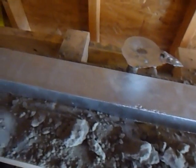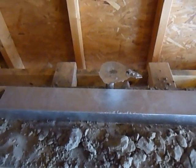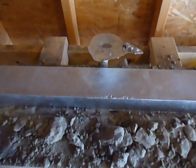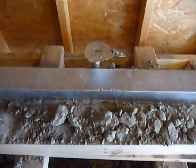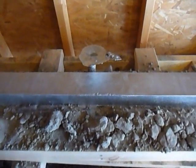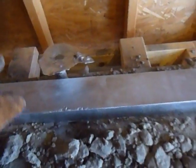I'm definitely psyched about my new molding sand that I put together. It's 100% Olivine and Southern Bentonite. There's a little issue here, but since there's supposed to be only 75% contact with the ways, I think I should be okay. Maybe I could fill it in with some JB Weld or whatever.